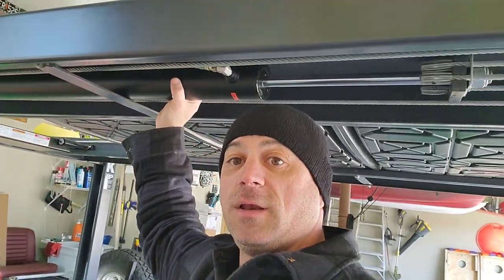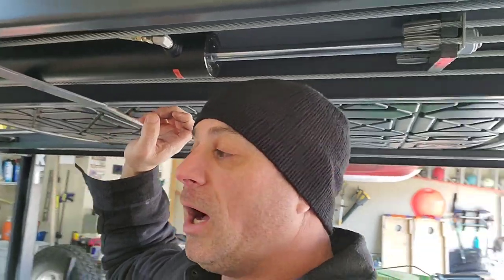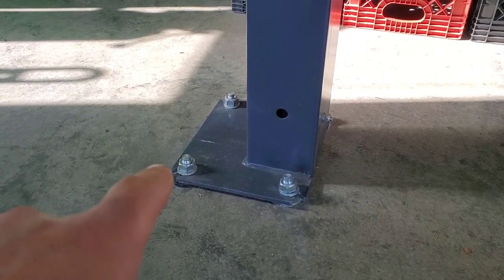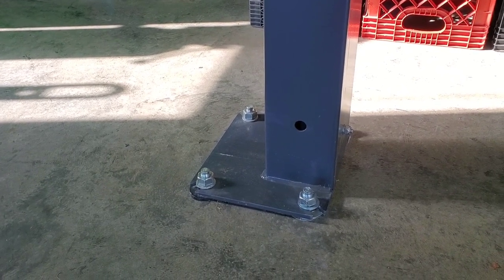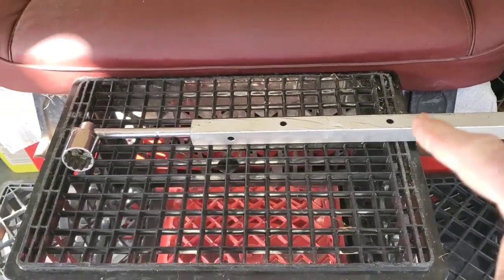The piston on here is about seven feet long — it goes way over there. I visually inspected it, checked all the brass fittings, looked at the seals to make sure nothing's blown out, and looked for any visual defects. My lift is bolted to the floor, which I feel is safer — every time you hit the ramps you're pushing the lift a bit, and bolting it in means I don't have to worry about it moving. I periodically check the torque on the bolts to make sure everything's tightened down, and I'm glad I did because some were a little looser than they should have been.